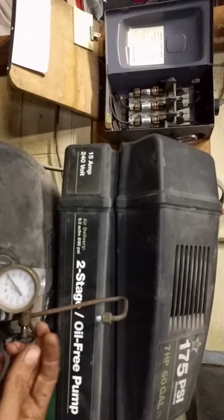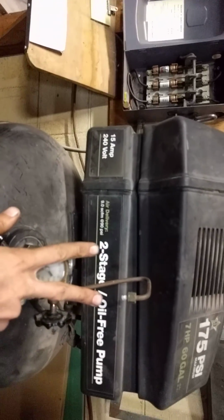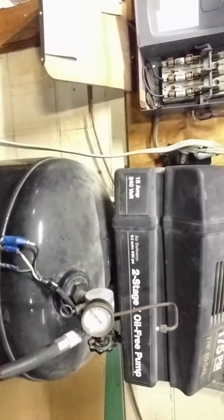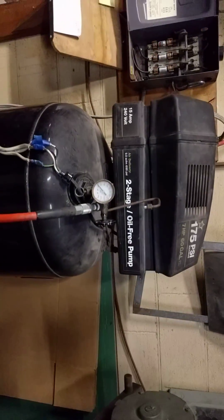What I did do is, when the pressure switch was leaking, I tried to flip it on, and I took the cover off, but it was sparking, so I was kind of worried that the motor was burnt out or grounding out or something. So you can see my little hack job here, but I just hot wired my motor directly just to make sure it would run just fine. So the motor's fine, that worked. It's not plugged in right now, I got the welder plugged in, but I wanted to rule out the motor. That's probably the most expensive part.